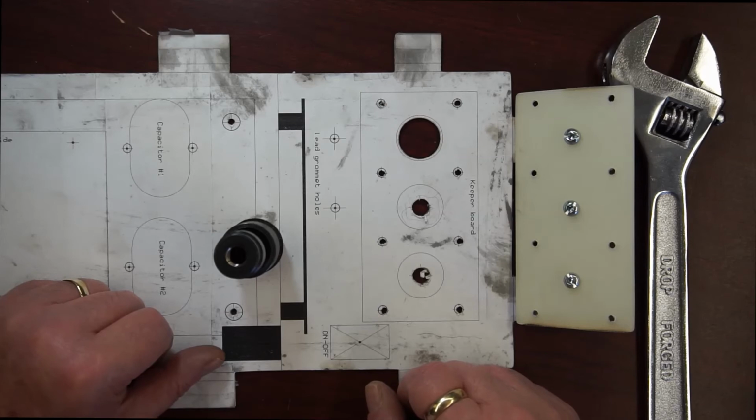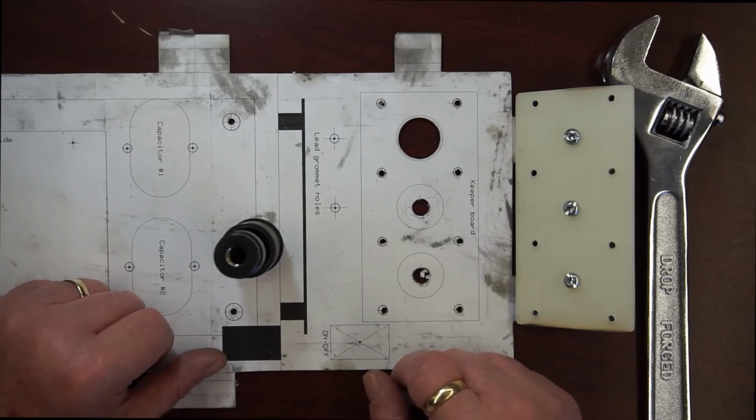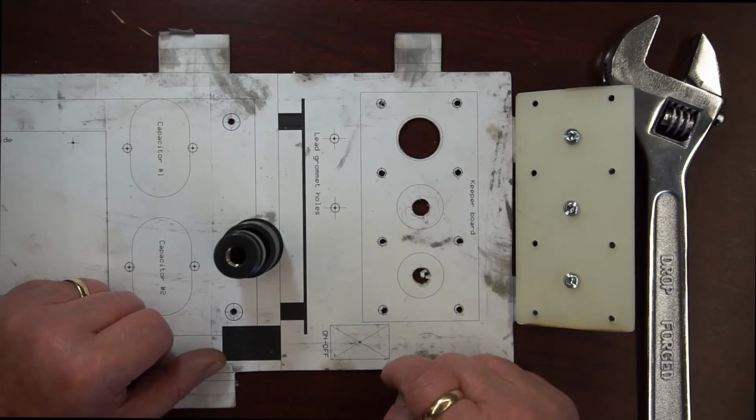My advice is to avoid using a large drill bit, such as a 3/4 inch drill bit or a 1-inch drill bit. A large diameter drill bit can easily tear into the aluminum sheet. Even with a drill press and using a lot of care, it only takes an instant for one of the flanges of the bit to bite in to the aluminum and leave a warped mess.